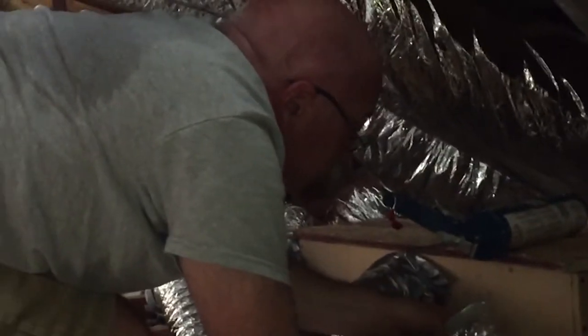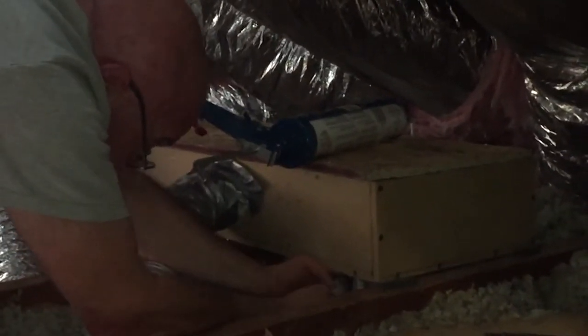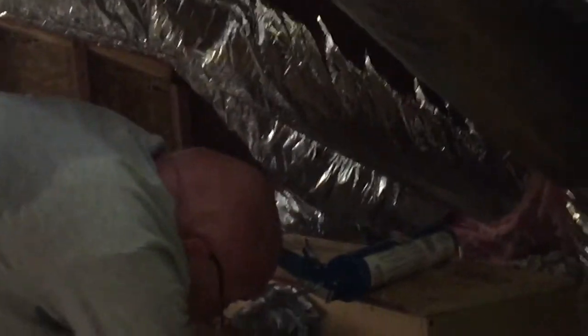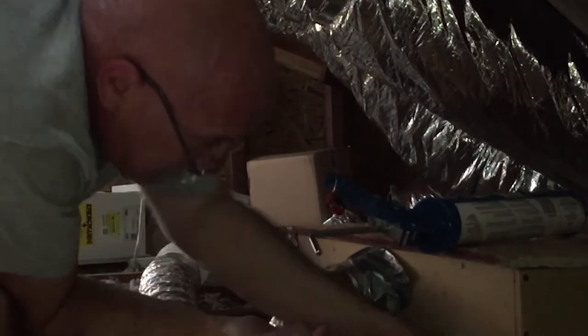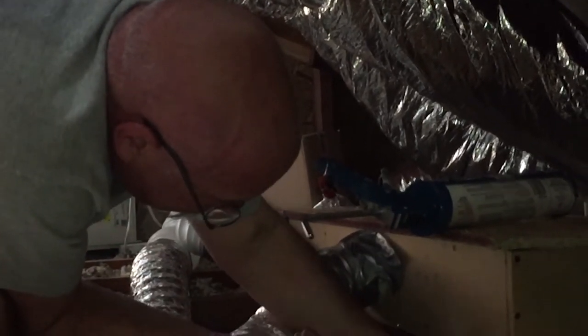This is the genius Dan Leonard at work. You see that right there? That's the plenum - that box. See those little vents coming out? Those are going down into the booth, sort of a forced air exchange. He moved the motor five feet away - it's way over there in a box - so that we won't hear it from inside the booth. Brilliant. That's a pretty nice attic, right?